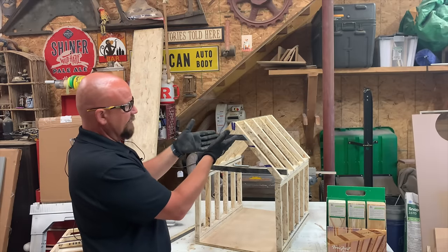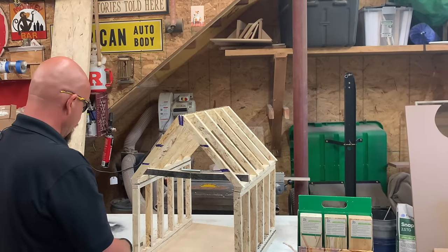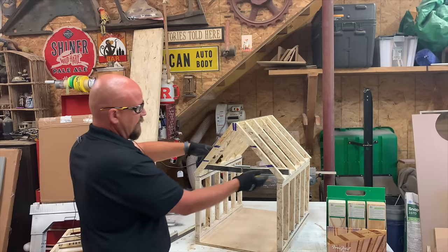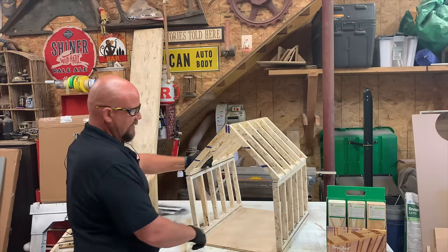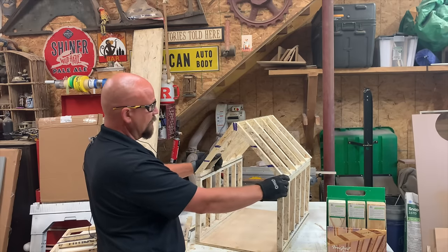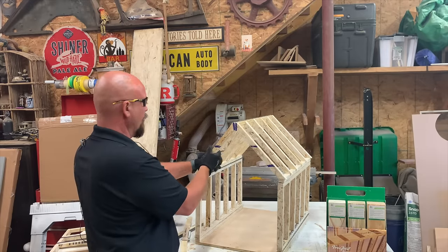Now, if you wanted to get rid of the collar ties above to create more attic space, as we pull those out, you can see we're starting to create even more tension. As we push down with excess wind or snow loads, it starts to spread more. When we pop out the last of our rafter ties, we've lost all stability within the roof system. In reality, the house won't crumble like this — you'd see walls kick out or start to move, and in old houses you may see the ridge sagging along with walls that are beginning to buckle or bow.